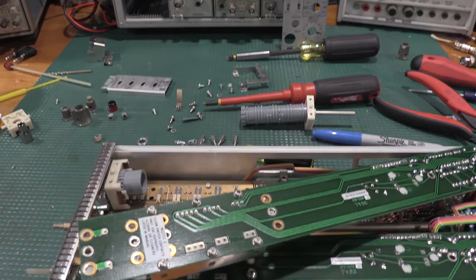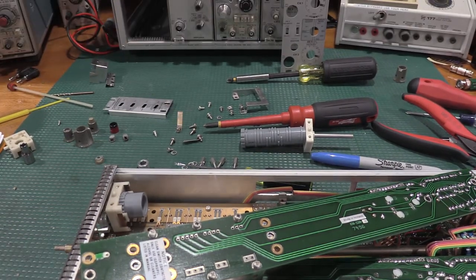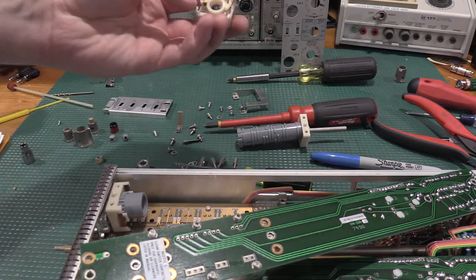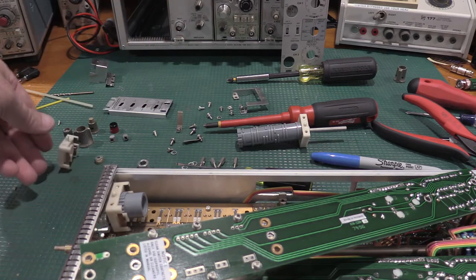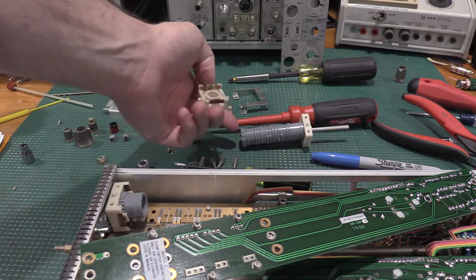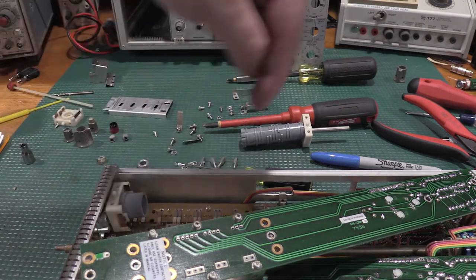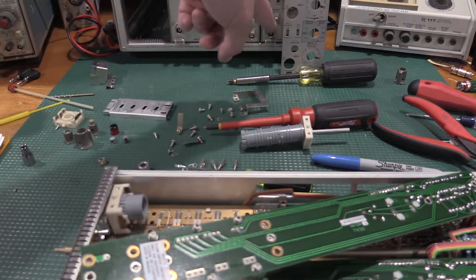I've got the switches exposed down here, but this is how far you have to tear them down. The cam switch is out. I made a mistake. I gotta get this re-indexed, and then set back up. The stops on the cam switch are actually on the back side, not the front side, so I need to get that re-indexed on the cam before I put it back in, but you got to tear the whole thing apart. The front panel's over here.